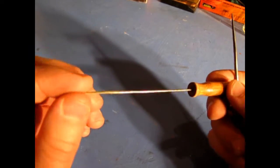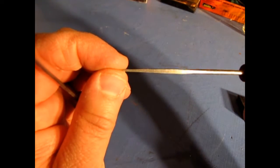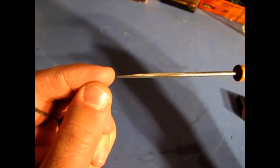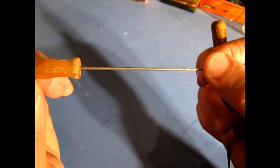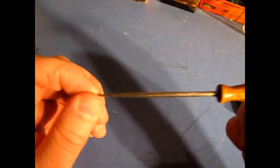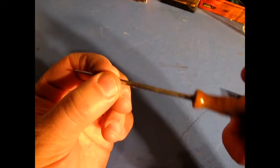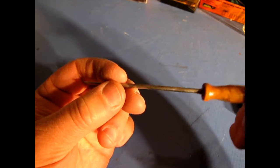Okay, these hole enlargers, my dad made them. I don't think you can see it on the little one. You can see it better on the big one. It's actually flat, been hammered flat, and a bit wide at the point. And the idea here is, if you drilled a hole and you're trying to put a piece of plastic in the hole, sometimes the plastic is not quite 100% circular, right? So you use a hole enlarger in the hole, and you twist it in, and it will enlarge the hole a little bit and make it not perfectly circular, so that you could put that plastic piece in there and it would hold it better.